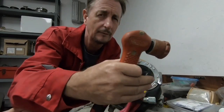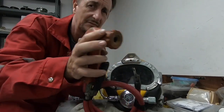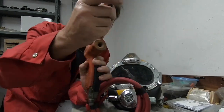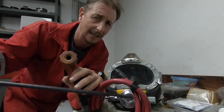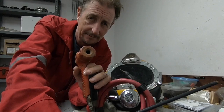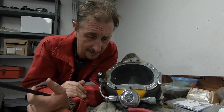It consists of one of these, which is a pistol with a valve — a hand-operated valve for the oxygen — and a simple chuck in the front. That chuck accepts this rod here. It goes in there, winds up tight, makes a gas-tight seal. There's also electric current plumbed to the gun too, so it's made live. And you strike an arc on the piece to light the rod.